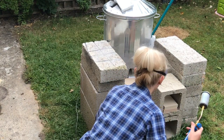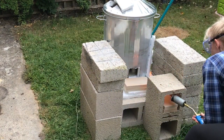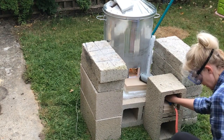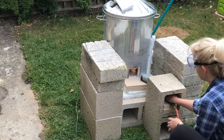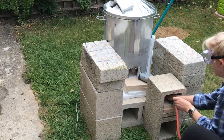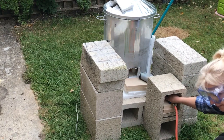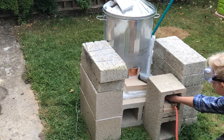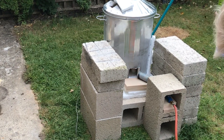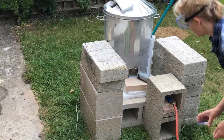When I'm lighting the burner, I just turn the fuel on a little and then light it with a match and then position it at the kiln. I've read accounts from people where they put the burner at the opening of the kiln and then turn the gas on and then light it — what can happen is that the kiln fills up with gas quite quickly and when you light it, it can be quite dangerous. So what I do is just light it first and then put it in place, rather than positioning it at the kiln opening and then turning it on.